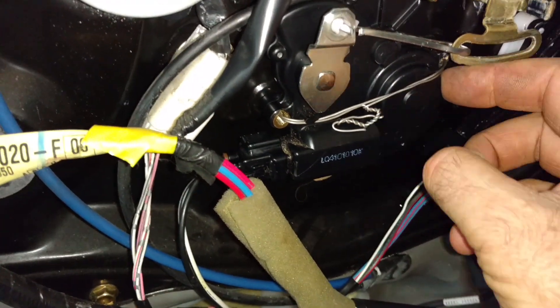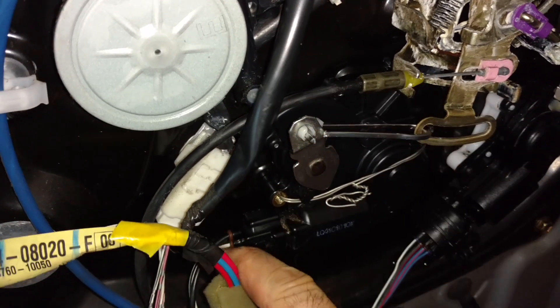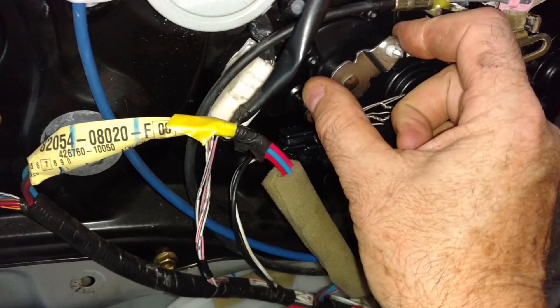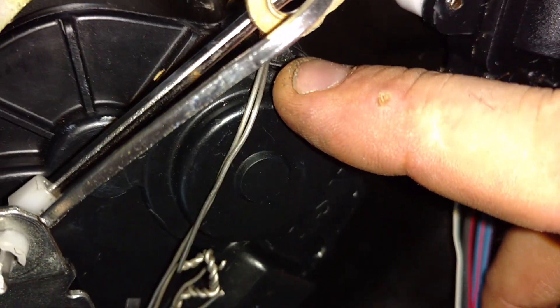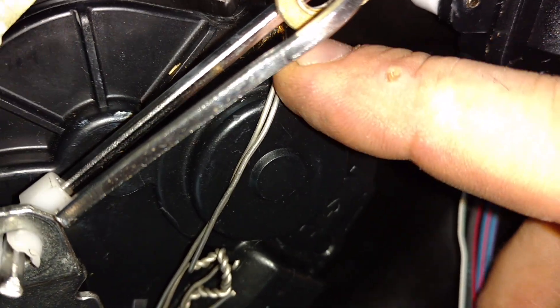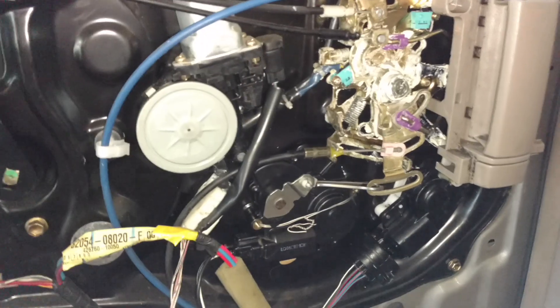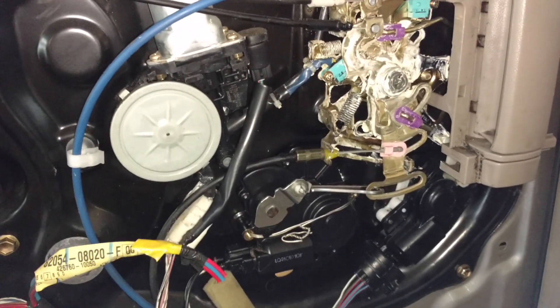That's how I repaired my door, which had the classic problem of the latch motor using up its brushes — I took it apart and they were pretty well used up. The new motor does the job well. One more thing to watch out for: my drill bit ate into the case, so I should go back with a piece of electrical tape to keep dust from entering the gearbox. There you go — the redneck way to repair your Toyota Sienna door on a budget. Happy travels!